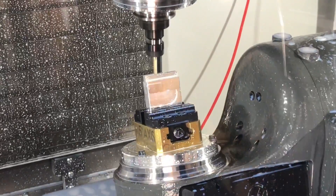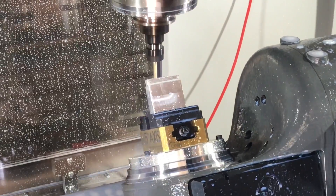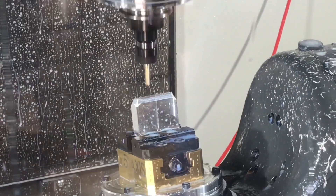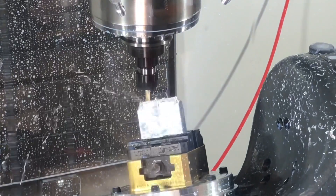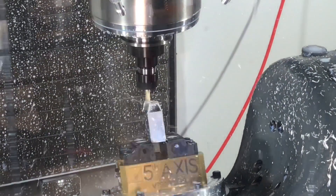It's just a simple little kind of like rocketing back and forth. This is just a flow toolpath where the software tries to keep the tool normal to the surface of the part. And then there's this part right here, and this is kind of what you probably think of more as 5-axis. This is a full 5-axis simultaneous swarf cut. And you can see it's a little bit choppy.